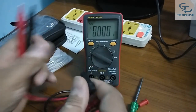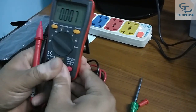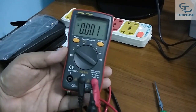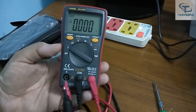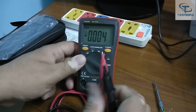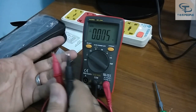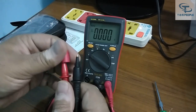Let's open it and we shall be doing all sets of testing on this multimeter. It's quite hard when inserting the probes, but now it's inserted. Do remember: put the black part onto the COM and the red part onto the voltage if you are measuring voltages and resistances. If you are measuring current more than the milliamp range, you have to connect the red lead to the ampere port. The lead tips also have covers — for PCB testing you can use them as is, or remove the cover for other testing.